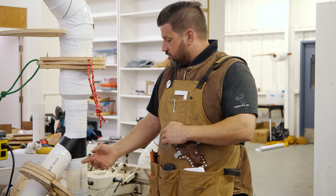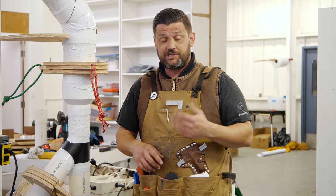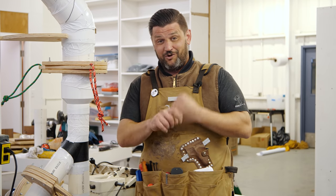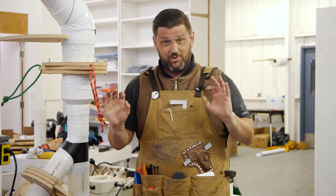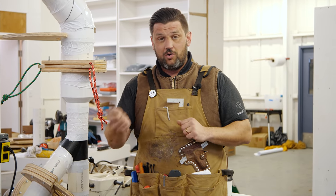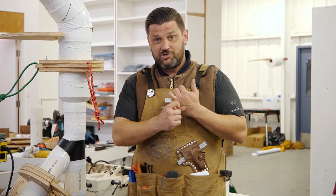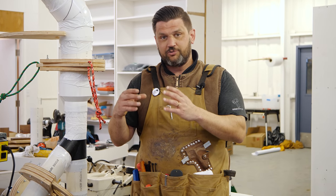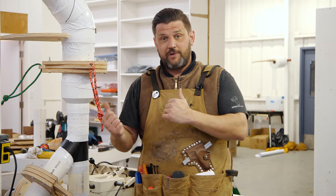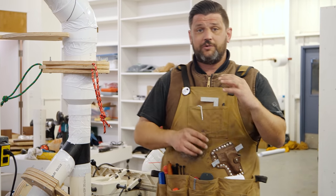Metal blast gates are bad — not in the good way these videos have sucked. I created wooden blast gates that are real game changers; the plans are on my website. They eliminate the gap caused by metal blast gates when open, are easy to see whether open or closed, and are way cheaper. Even with nice maple plywood they cost about four dollars each to make, versus 12 to 13 dollars for four-inch metal gates and around 20 dollars for six-inch metal ones. Also, the floor sweep is one of the coolest things I added — I'm probably going to add a hose port for walking around the shop to vacuum as well.